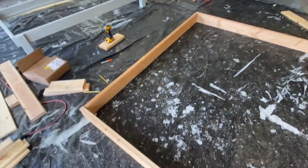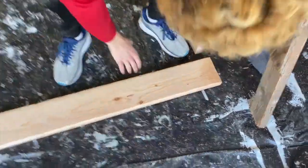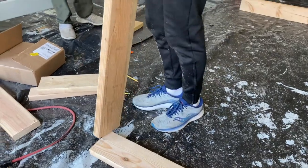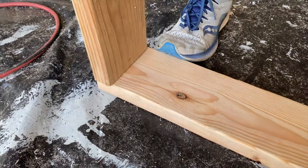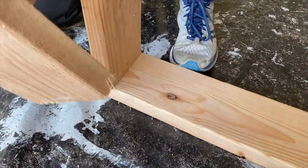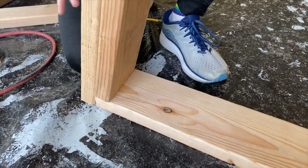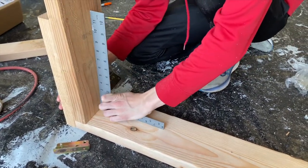Once you've cut the pieces, lay them out in a square and start putting the brackets on. Put the shorter end of the bed down, then have somebody help you take the longer end and place it on top, making sure it's squared off. I like to use another piece of wood to square it off — put it on the ground next to it and level it. Make sure it's square one more time before you put your brackets on.